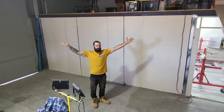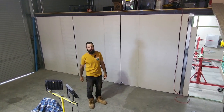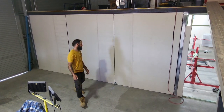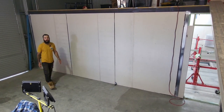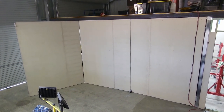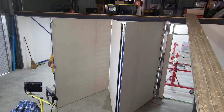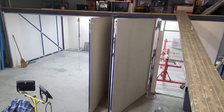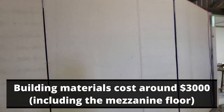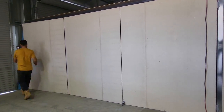Welcome to Twisted Metal Customs — the spray booth update, 98% done. We're going to go around and show you quickly how it works and what we've done. This is the door and how we open it up: it's a trifold door, three doors welded with opposing hinges. When I'm not using the spray booth I can open it up, push cars in straight along the side with wheel dollies, or on the rotisserie, and utilize it as a fourth bay.